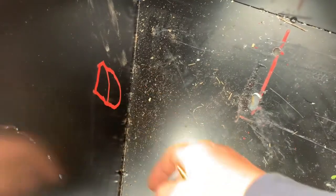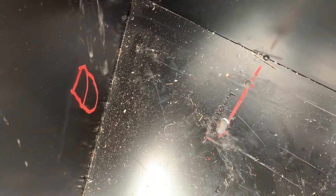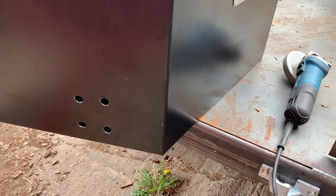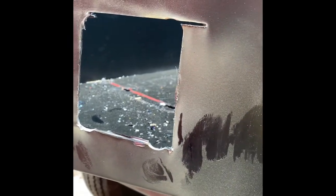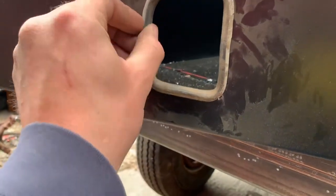I got the box back off and figured out all the mounts. Now I just have to drill the holes for the hydraulic lines. I'm going to use a drill bit in the corners and cut out the sheet metal with probably a Sawzall, then figure out a way to put a nice edge on it. Here you can see the holes I got drilled — I'm going to use the four-inch grinder with the cutoff wheel to finish this up. Drilling the round holes made it look way better than just cutting a square hole.